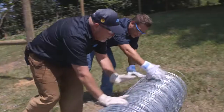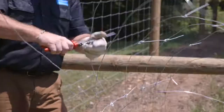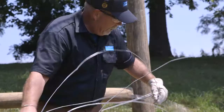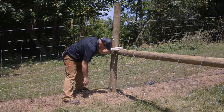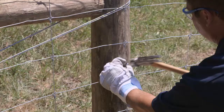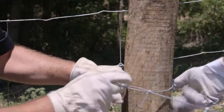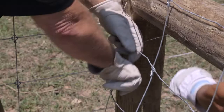Roll the wire out. Strip the knots so you have enough wire to tie off at one end using the high tensile slipknot. Put a couple staples in to hold the wire in place. Be sure it is straight on the post — this will ensure the wire tensions straight. Begin tying off each line wire using the high tensile slipknot, and be sure to position the fabric so the top rail is between the second and third wires from the top.